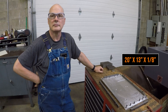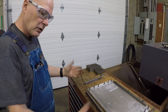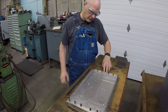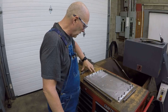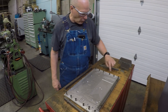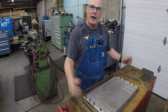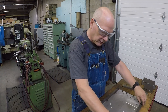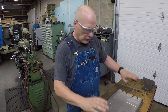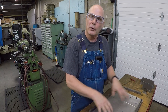A thin aluminum extrusion of that aspect ratio — that thin and that wide — it is a potato chip. It is curved, bowed, and twisted. When I mount it on the machine there are two square blocks that lay in here and these bolt to those. When I clamp the sheet down I put a clamp here and a clamp here, then go around and drill these holes — which are the holes that mount this on the cabinet. Then I have a program stop, put this clamp on and that clamp on, then remove the initial clamps.